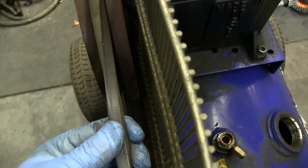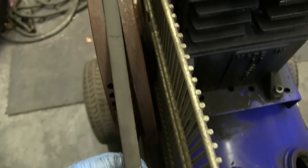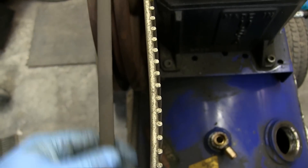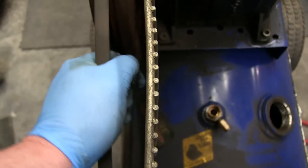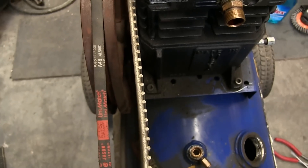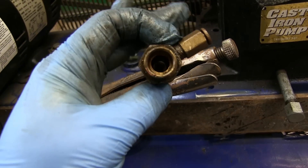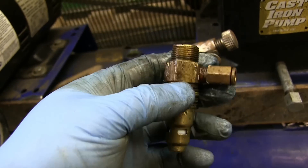I've got the guard off looking at the belt — it's in fine shape. No chunks, no glazing, no cracks. Pulleys are all on and not fretting. Just give everything a good solid check and have a smell, have a look — make sure it has good tension. One thing about fractional horsepower belts is they don't need to be singing tight. Here's the one-way check valve backflow preventer — Teflon bushing in there, and you can see daylight, so when there's pressure on this end it forces that up, seats it, prevents backflow back into the cylinder.